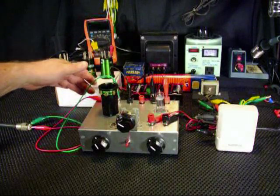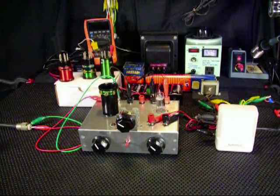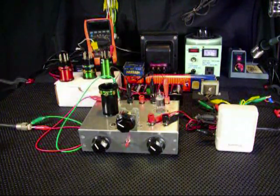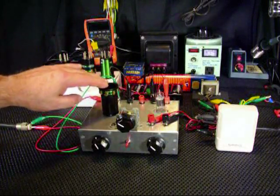The center conductor goes into the regenerative receiver and acts more or less as a long wire. We have our A and B batteries hooked up. The white box has ten 9-volt batteries in series, providing the 90 volts for the plate current. The four D batteries back here provide the filament current at 6 volts, which is adequate for the 6BF6. We also have an output transformer hooked up so we can listen through a small Radio Shack speaker and built-in amplifier. We've got an 80-meter coil here.